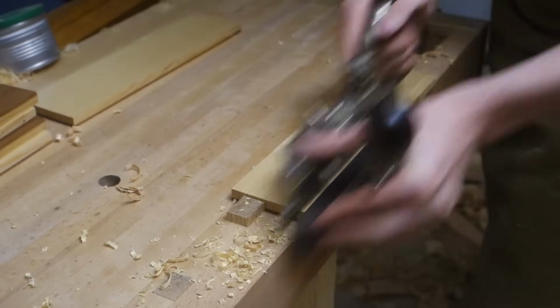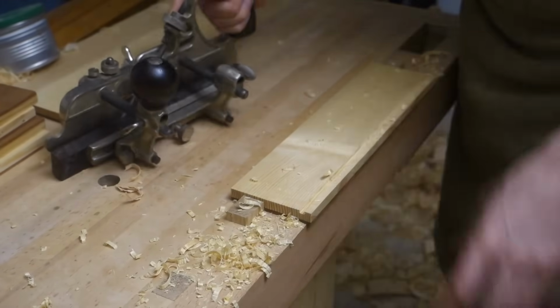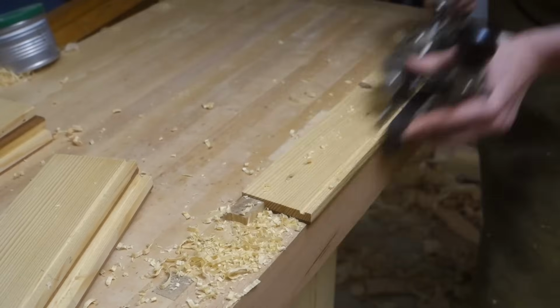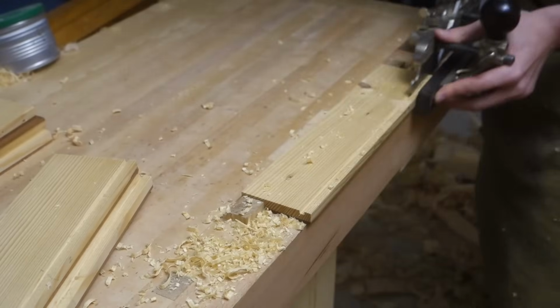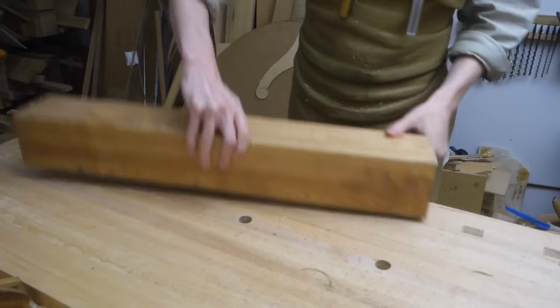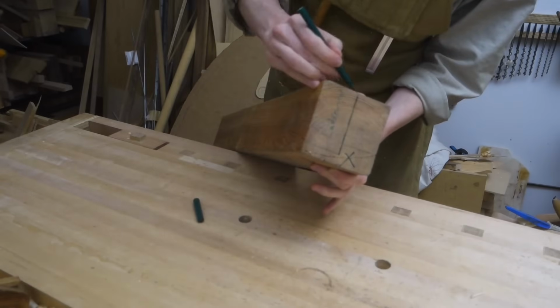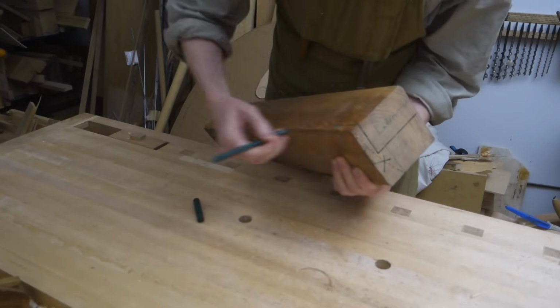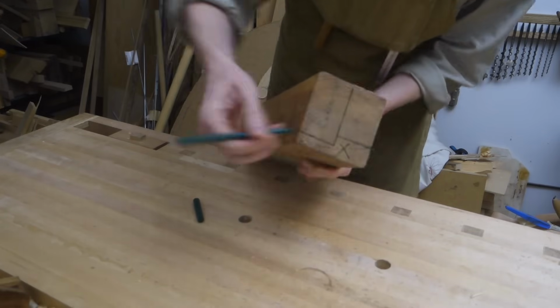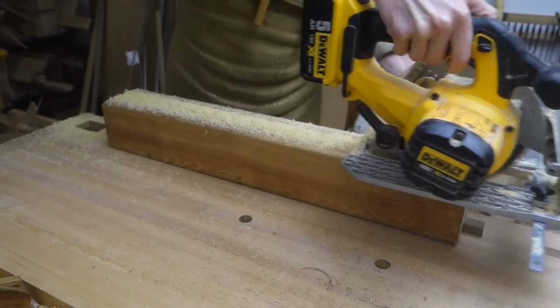After fitting, I made grooves for the drawer bottoms. I also need drawer fronts, and these started life as this old 4x4. Once more, I laid out my parts to cut around the pith and major splits and get as close as quarter sawn as possible.